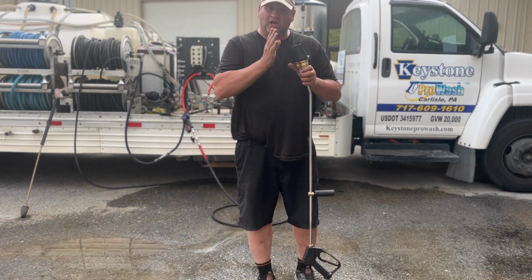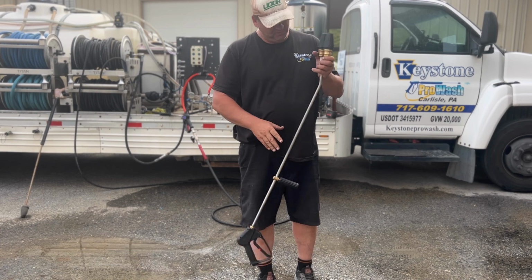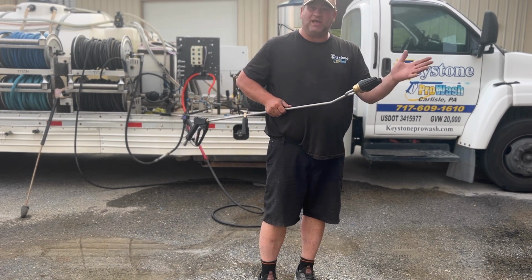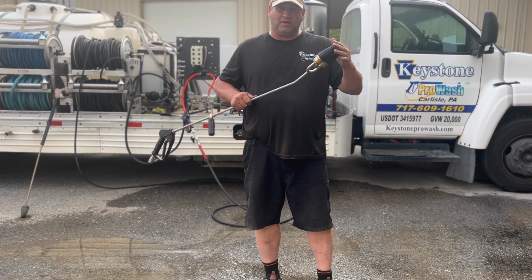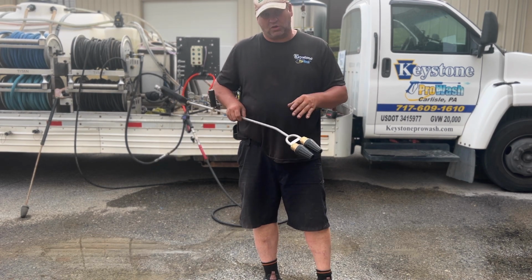Like I said, I always upsize it 2 gallons. 10 gallon, get a 12. 8 gallon, get a 10. Like I said, it's not the pressure, it's the volume and also the agitation. And that's my opinion. When you start maxing out your pressure to 3,000 PSI with one that's, like say this is for 8 gallon, you start destroying things and making marks.